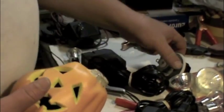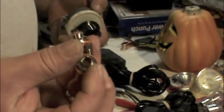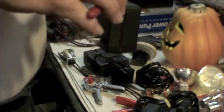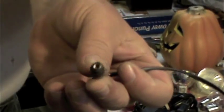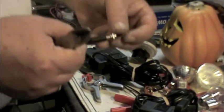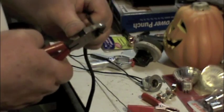This is what I'm going to set as the control side. It's a Halloween pumpkin, and I have the connectors and the rheostat — 35 ohms. That's what I use with 12 volts or 18. To start, I need the connector for the electricity, so I use just the tip of the cord. I put it together — soldering a DC terminal that I'm going to use for the power supply.